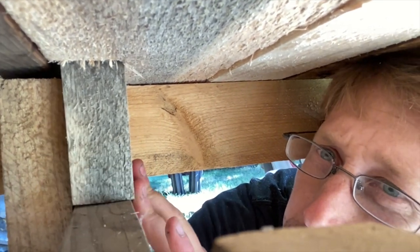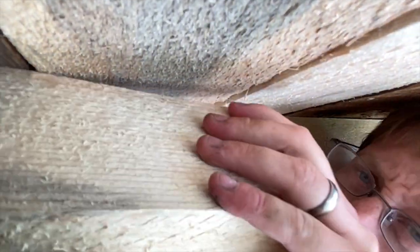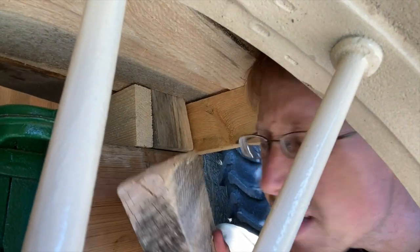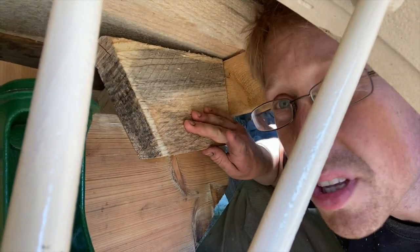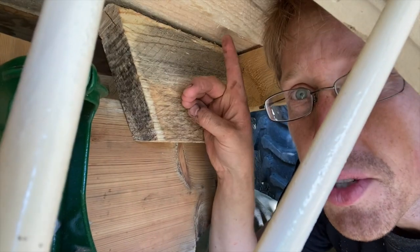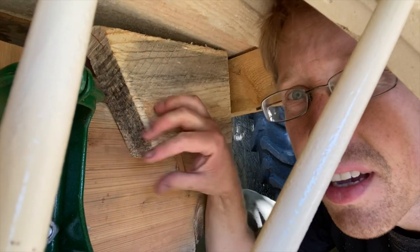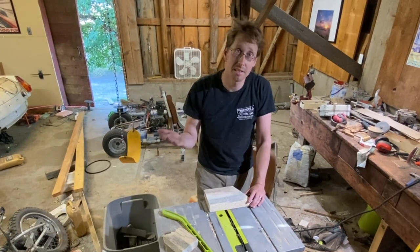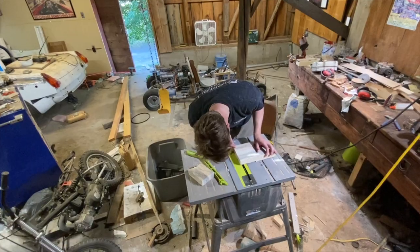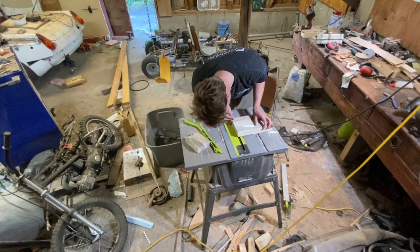Now it comes to the real structural support, which is all underneath. We're going to build a cross piece that goes in behind, and then it's all getting sandwiched in with a large piece here, which is screwed in both to the main frame down here. Plus, this will get screwed in through the top decking, sideways into that back piece, and through the front over here too. And of course, since the mainframe is finished lumber and my verticals are going to be rough cut, I've got to trim out a little bit of recess on the side support as well.